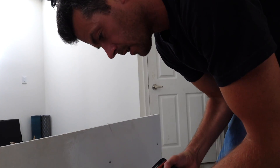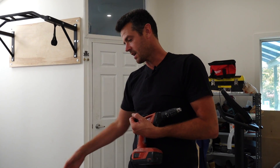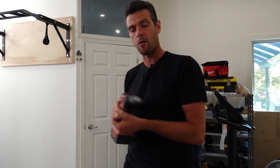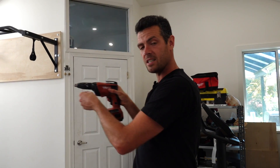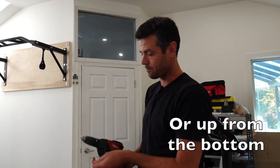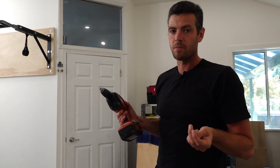Now let's go to the coarse thread. These will do their job — it goes in faster because it has a point. That one would be a screw pop down the road. Part of the reason that happened is this is just a janky little L-shaped wall in a garage, not a properly braced framed wall. Anyone who's actually hung board on steel stud knows that on a 10-foot wall, if you try and start your first screws in the middle of the sheet, it pushes the steel stud out and it's common to get it spinning out. What I usually try to do is work my way down — grab the stud and the board at the same time, fasten it so it can't move, then work my way up from there. That way it doesn't push the stud away and ream out the drywall, so you won't be as likely to get screw pops.